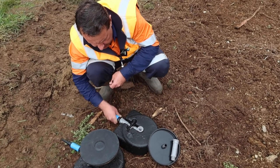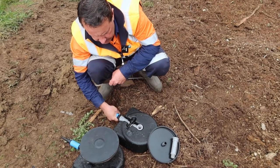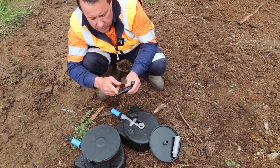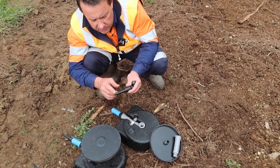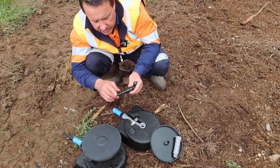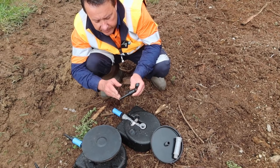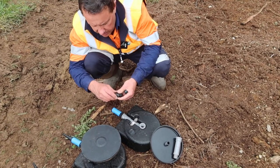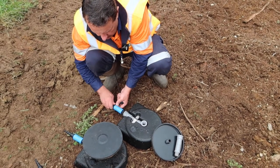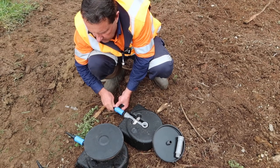This simply screws in like so. You don't have to over-tighten any of these fittings and you don't need to use plumber's tape. This fitting has multi-stage hose tails: if you're using the 3/8 inch hose, leave it as is. If you're using the 1/2 inch or 5/8 inch, chop off the shorter ones to open it up so it doesn't unnecessarily restrict the airflow. Then that goes in like so.